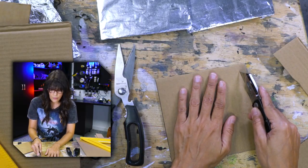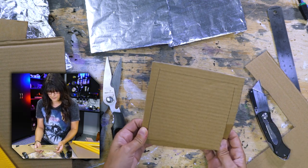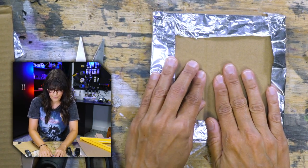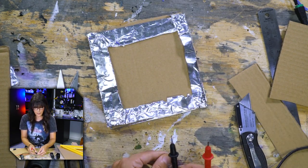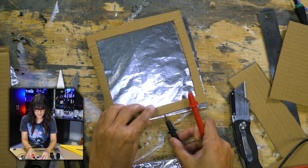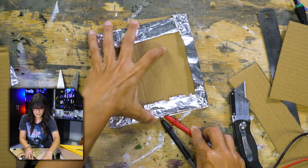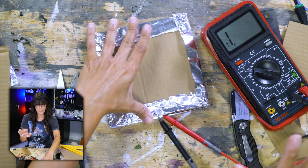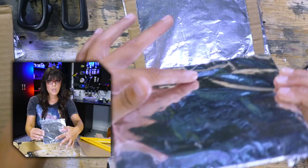So now what I'm going to attempt to do is punch out the middle. I'm not going super nuts in terms of getting it perfect because it's just a separator. We have a place in the middle where the person can step. Let's make sure this thing works before we go any further with the wiring. I'm going to put one of the probes in and sandwich it - isolated from the top part. We're getting beepage when pressed and we're not getting beepage when it's not being touched, so we know we're not getting accidental contact.